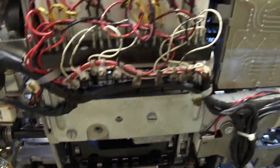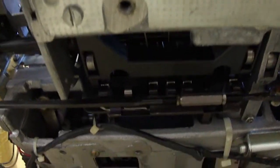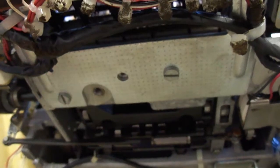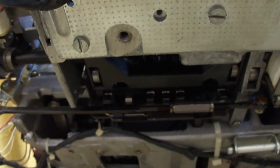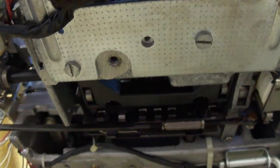In the mechanical version, there's just a mechanical linkage from these bars under the keys over to the tilt-rotate mechanism. The way that these bars get pushed down determines which levers get pulled out, and the codes relating to the combination of levers that get pulled out relate to what character the typeball — the element — is positioned in.